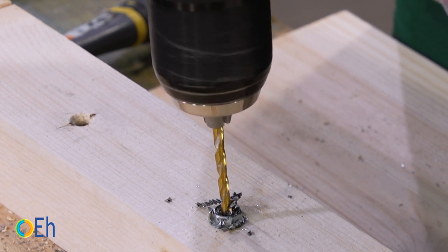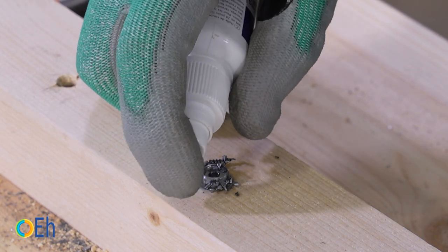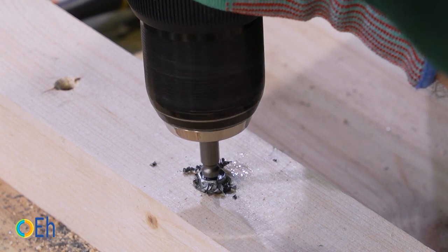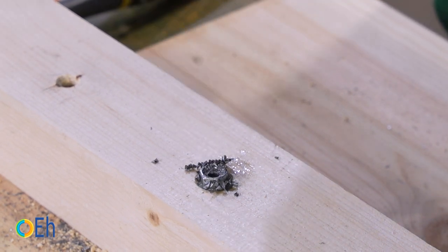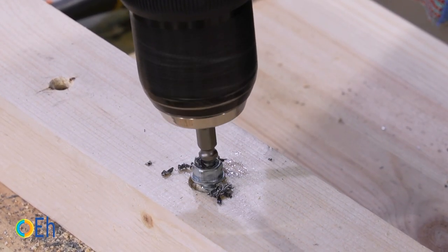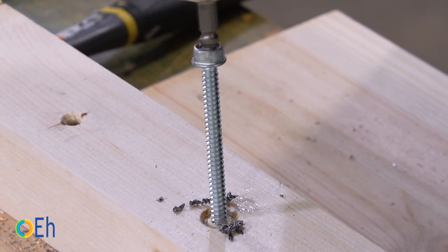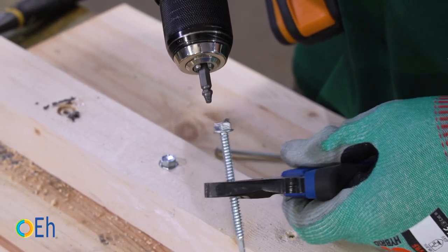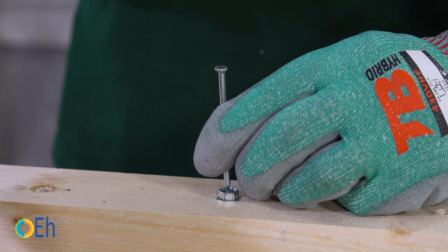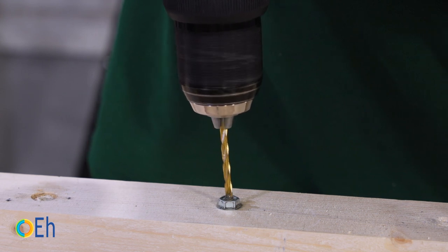As you can see, with the drill bit of 5/32 inches, we can put pressure without breaking it and we can move forward. Let's now apply the drill bit that we had prepared, turning in the opposite direction. And, once we have done the basic hole, we can insert the extractor screw. We continue with the extractor working counter-clockwise. We turn and see how easily the screw comes out. To release it, as it is screwed to the head, we need to change the direction of rotation while holding the screw. In this next screw, after marking the center of the screw to position it as best as possible, we will work directly with the 5/32 inch bit and, as always, with thread cutting oil.